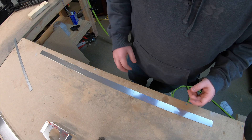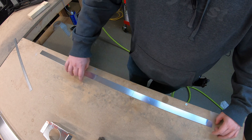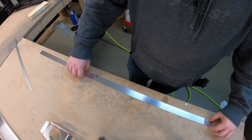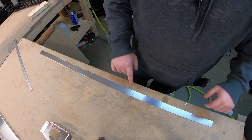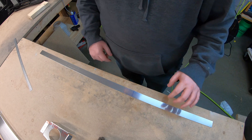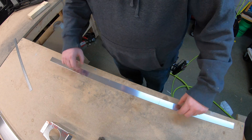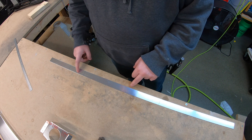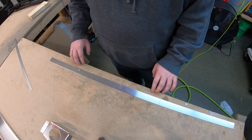Now we get to do a little bit of fabrication here for the rudder. They give you a couple of dimensions — this 032 length aluminum, a little over about 36 inches long. You're going to cut it down to 14 and 3 quarters of an inch, two times for the R7-16s. And then you've got this little strip down here at three and a half inches that you're going to be using as a spacer for the R7-17.